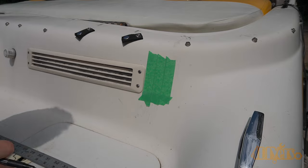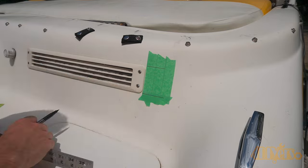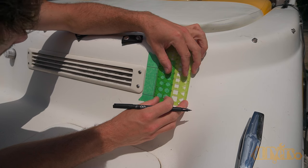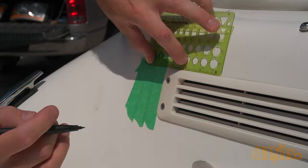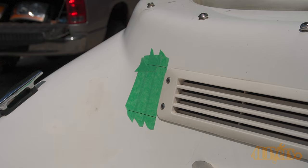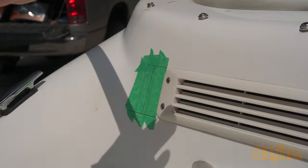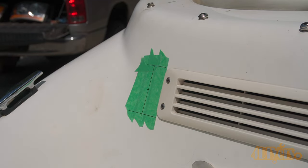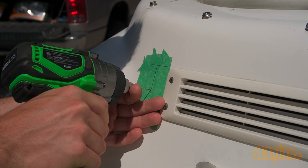For placement of the lights we are required to drill holes for the mounting points. Drilling holes can be tricky on a boat. I found that making reference marks based on fixtures isn't always reliable as they aren't always symmetrically placed and the boat isn't 100% square. I did my best making reference marks for the hole placement. The lights have the same locations on the left and right sides. This is fiberglass, so I would highly recommend wearing a mask when drilling. Tape is used for the layout and reference lines are drawn. Make sure hole locations are far enough away from any objects where the bezel doesn't interfere, and check behind the panels so you're not damaging any components.